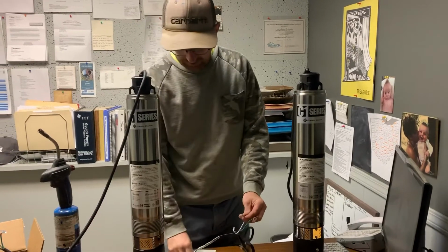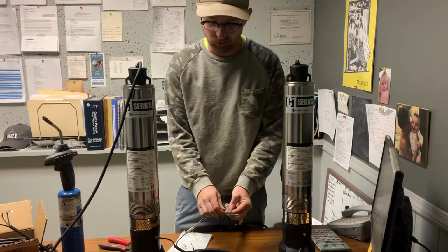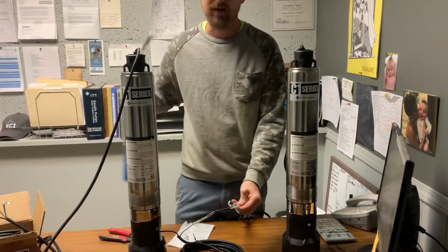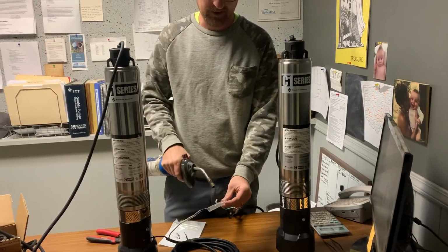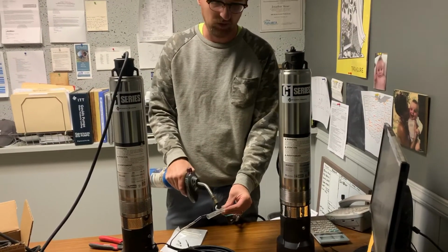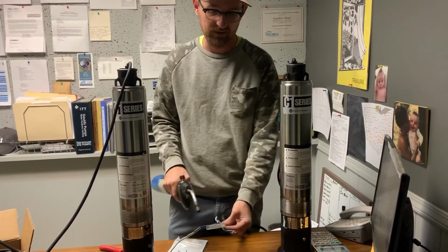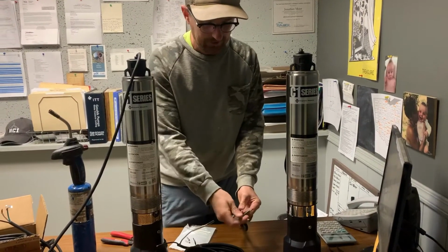And then you want to make sure that this heat shrink tube is on one of the sides before you splice the wires together. And with a propane torch, just heat up that shrink tubing. Keep the flame away from the shrink tubing. You don't want it directly on it. Just keep it back and slowly move it around until it gets a good solid seal like that.